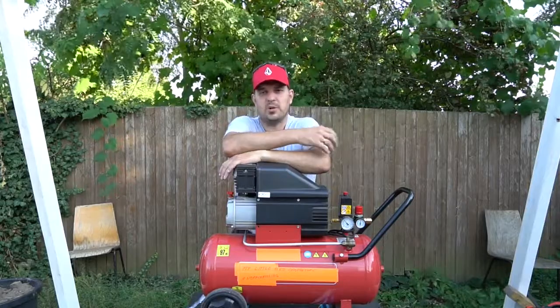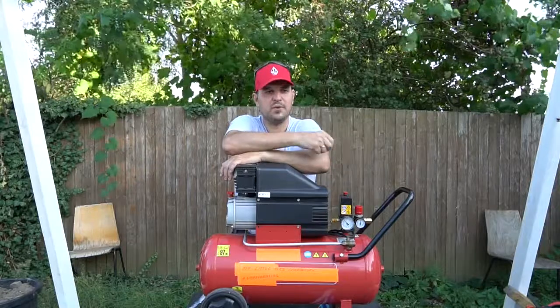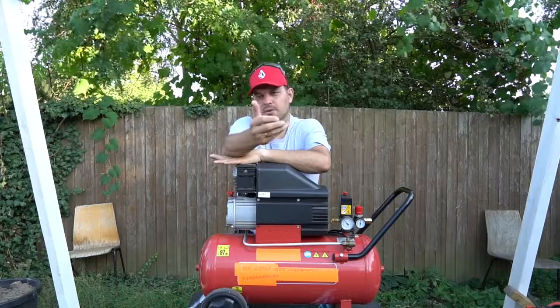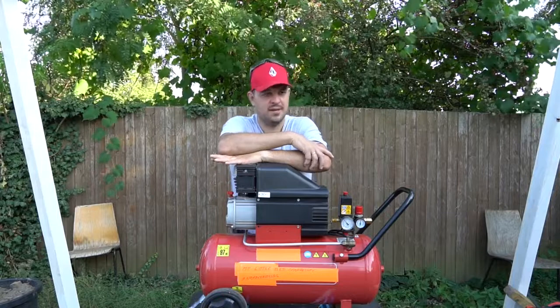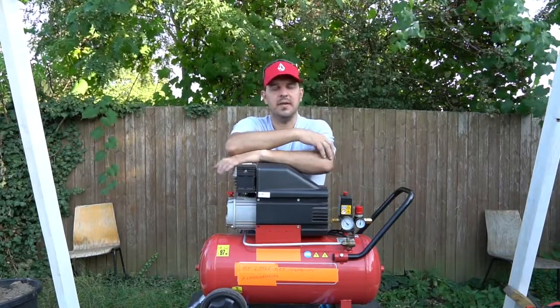Exception: if you're airbrushing, take a dry runner, oil-free compressor. For airbrushing it is always better, because oil in your paint job is never good. Sure, there are kinds of dryers, filters and stuff you can put into your hose, but they cost money as well.